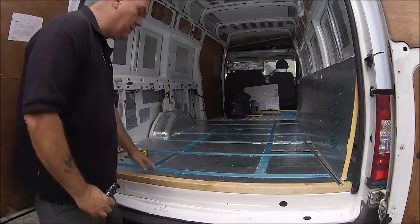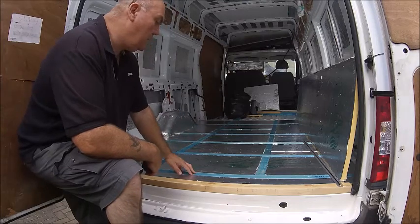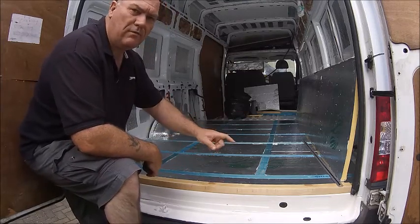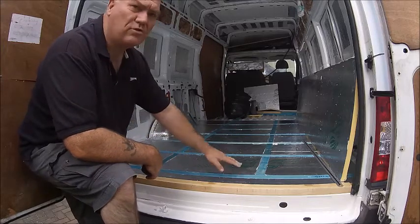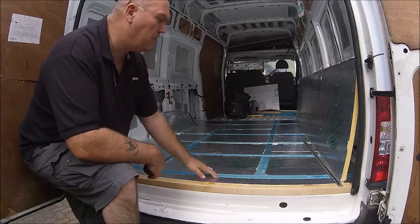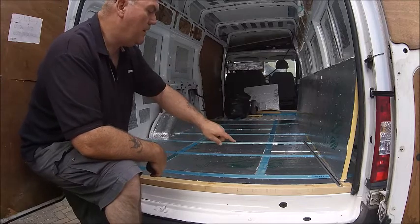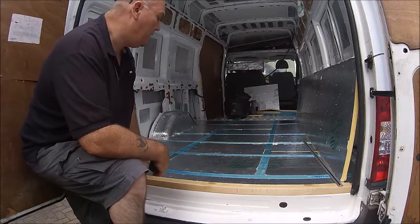So what I was doing the other day — basically I've put my 25mm timbers in now. Because the floor was a bit uneven, I've had to put some Sikaflex underneath, and also I've had to screw them in. I didn't really want to screw the battens in, but I thought, what the hell, screw them in. So I've screwed in the long bits and glued in the shorter noggins all the way up. It's now solid.